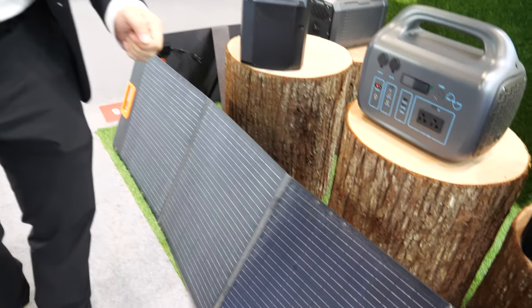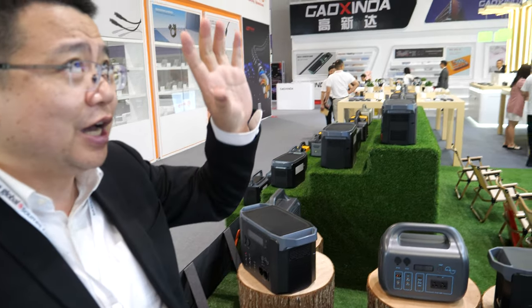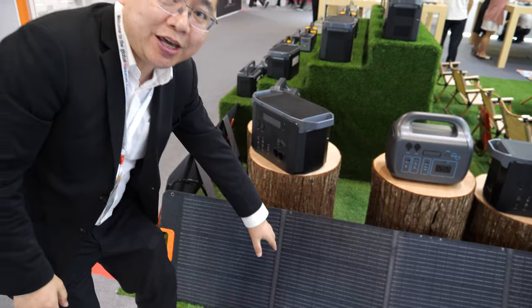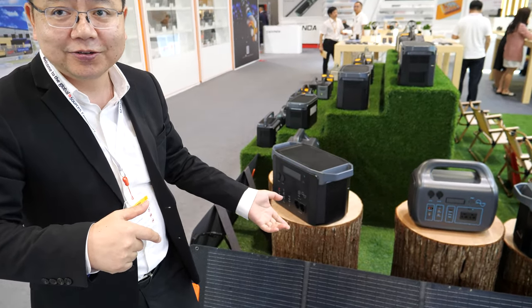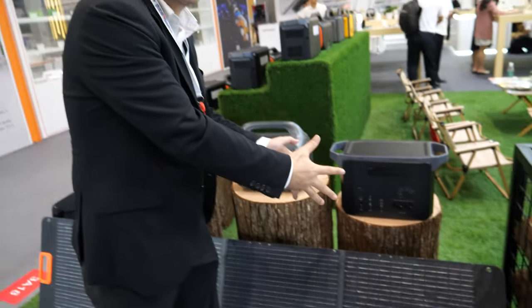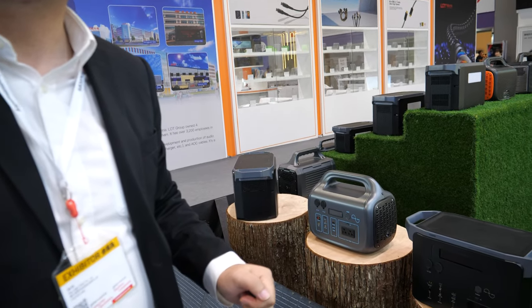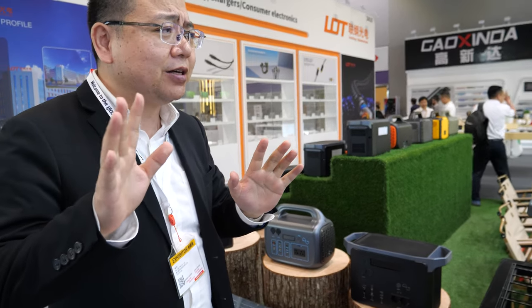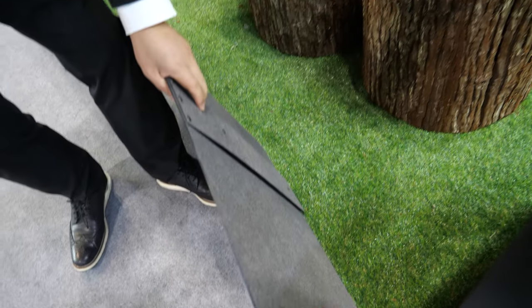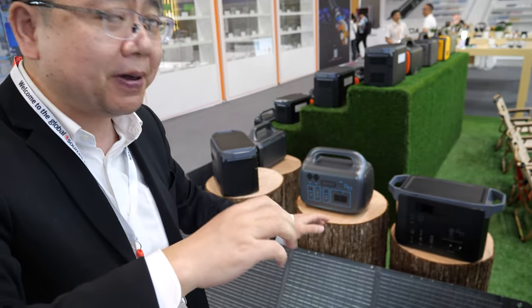Can I leave it on my roof all year? It's not suggested to use it on your roof all the time, because when raining, some water can store and sitting on your solar panels will destroy them. But you said it was waterproof? Waterproof means IP65 — a little bit. Not all the time. Maybe you can just pour some water on it and it's okay, but if you put the solar panels in water, it's not okay. You don't have a fully waterproof version? We have waterproof, but this is fabric — you can't do IP68. IP68 would allow placing the solar panels on your roof all the time, but the cost is so high, so we didn't do that.